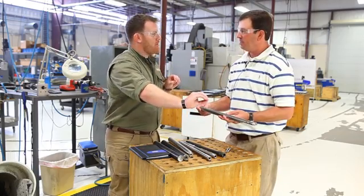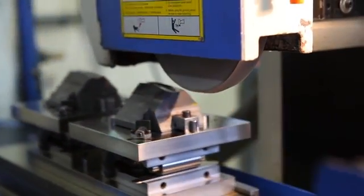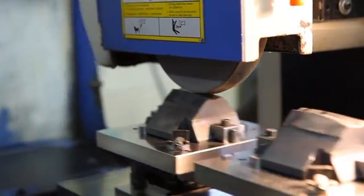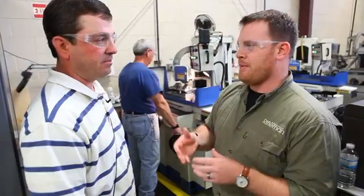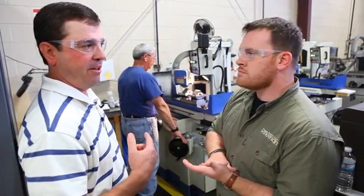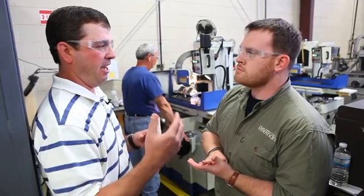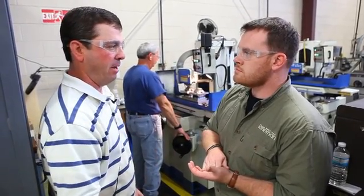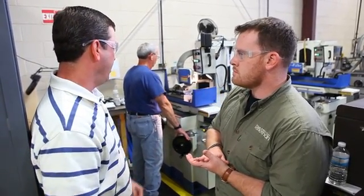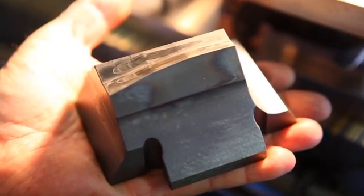You can see it really gets stretched out into much closer to a final product. There's a lot that goes into those cold hammer forging machines, not the least of which is maintenance on the hammers. He's actually resurfacing the hammers right now. There are about seven different angles on there, and after a run of a thousand parts, we have to do periodical maintenance — grinding, making sure all those angles are right. That's what he's working on now, regrinding those hammers back to the correct tolerances.